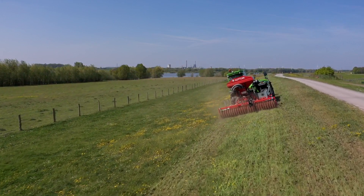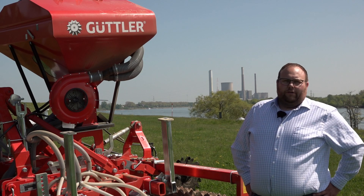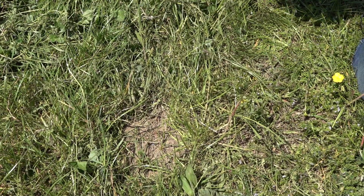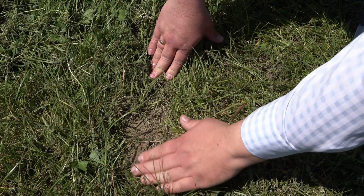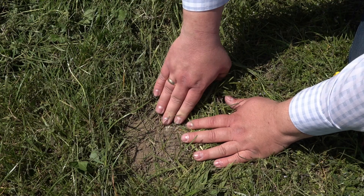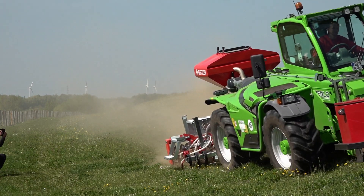Under the aspect that we press the seed into the soil but leave the old grasses lying on top, we effectively prevent regrowth of weeds and unwanted grasses. Looking at the surface here, we can see a beautifully scratched-up gap which we have seeded. The seed has the necessary soil contact in the crumbly fine-earth soil. The grain can now germinate optimally, the gap closes again, so we have fewer weeds in the stand and a good grass sward suitable for grazing by sheep.